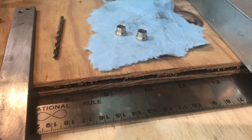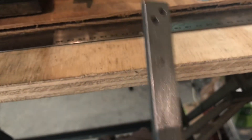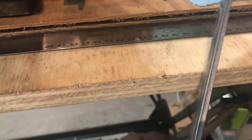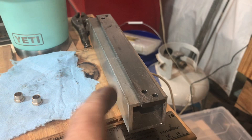Now I've got my blank for the coupling rod. This is a piece of 3/16ths inch steel that I just filed the mill scale completely off of this side so I can blue it and mark it out, and partly off of this side to flatten it a bit and give me somewhere to attach with crazy glue. My plan is to use crazy glue and bolts and bolt it to a clamp plate.